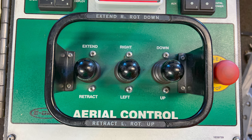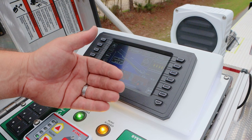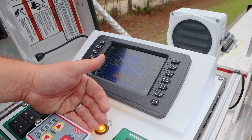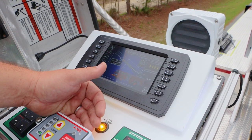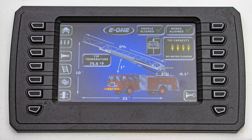Three joysticks — we have an option for two sticks if you're interested in that. Most commonly it's three stick, and then also an emergency stop button if anything needs to stop on the aerial. Coming up to the screen here, the Advanced Aerial Control System Deluxe is going to give you a ton of information quickly. It's lifetime 100%. So with this ladder being a 500-pound tip load ladder — tip load is full extension at zero degrees — the tip load can be different based upon certain elevations and extensions. On this home screen, you can see a bigger tip load indicated by the firemen personnel on here, and each one of those is 250 pounds.